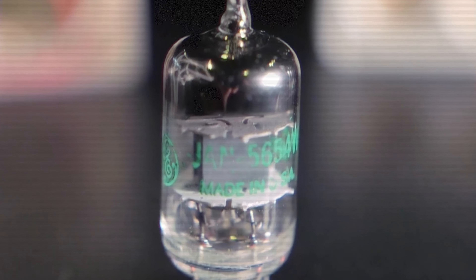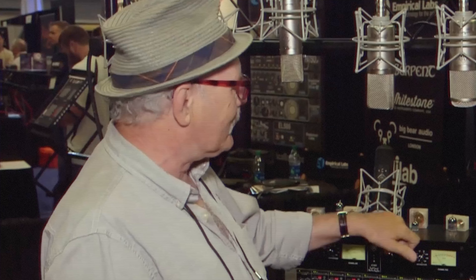Third, build quality. We're using a military-grade tube, a little smaller, draws less current, but gives you the same sound from the amplifier. We're able to buy these tubes in lots of 100, military quality, for $8 each. And they last longer than the 6AU6 in the Sony. That tube came out of a mantle radio — when I fixed mantle radios for neighbors in the 60s, it had the 6AU6 tube. So we're actually using a higher quality tube and getting the same sound, and the components today cost less. You get higher quality electronic components for less money today.